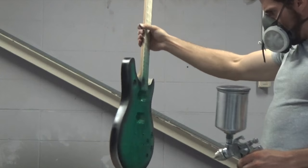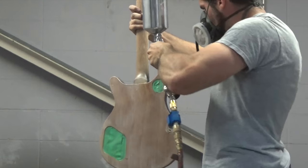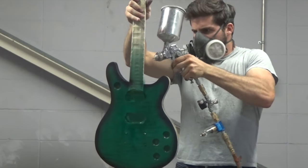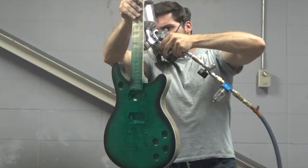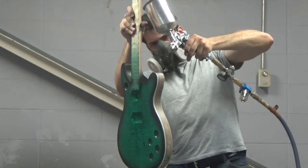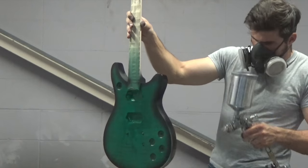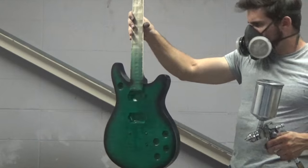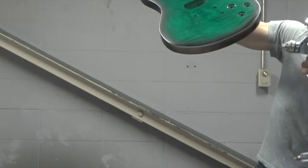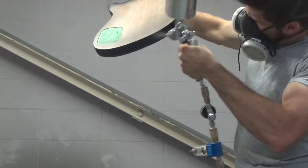You just have to be careful about your spray angle, distance, and trigger control. Moving on to the sides — the edges are probably easier with the fan pattern wider, but for now I'm doing them very carefully with the fan pattern all the way down, spraying a tight circle. When spraying the edges, I spray from the back of the guitar toward the front so any overspray shoots right past the guitar. I haven't masked the front and I'm able to avoid getting paint on it using this technique.